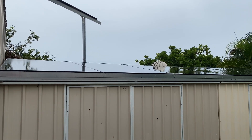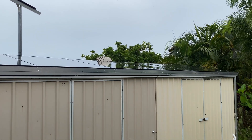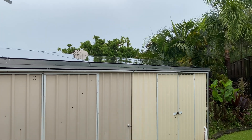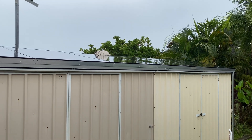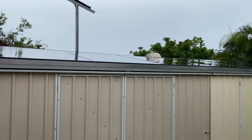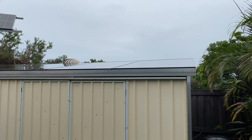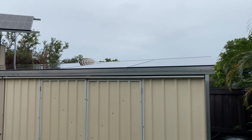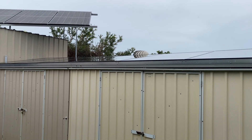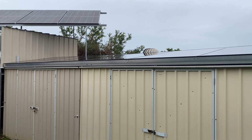The first array sits over the top of the power shed. It provides added protection from the elements — a bit of thermal protection from the sun and another layer of protection from the rain. These were just leftover panels. This little array consists of six 250-watt panels, two strings of three connected in parallel, back to the 150-35.